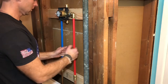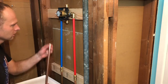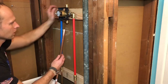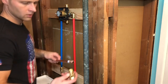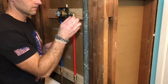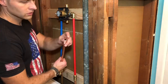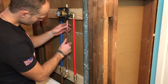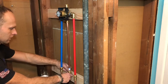Snap it in cold. I'm going to open up the bottom portion. Delta tells us to use copper going downwards, so that's what we're going with. First we're going to connect the left-side spout connector. I use the thicker wall copper piping — might as well go with the better choice, though either one will work.